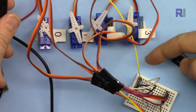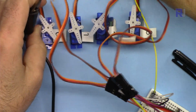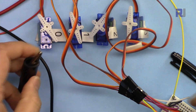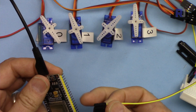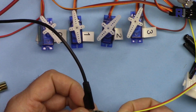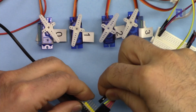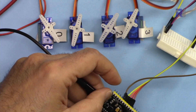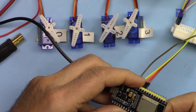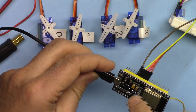The last one goes to servo 3. This is my external 5 volts power — I'm connecting the yellow wire and red to positive. I'm connecting the signal wires to pins 12, 14, 27, and 26, which are all side by side. The ground from here will be connected to the ESP32 ground pin, and another ground from the power supply connects to this module, so we have a common ground.